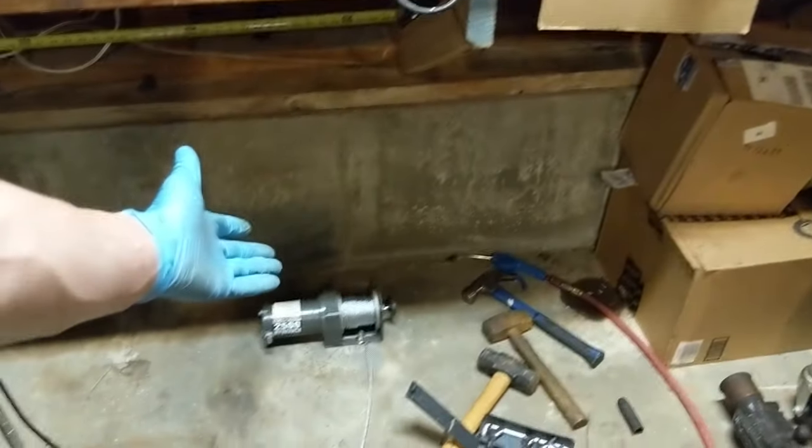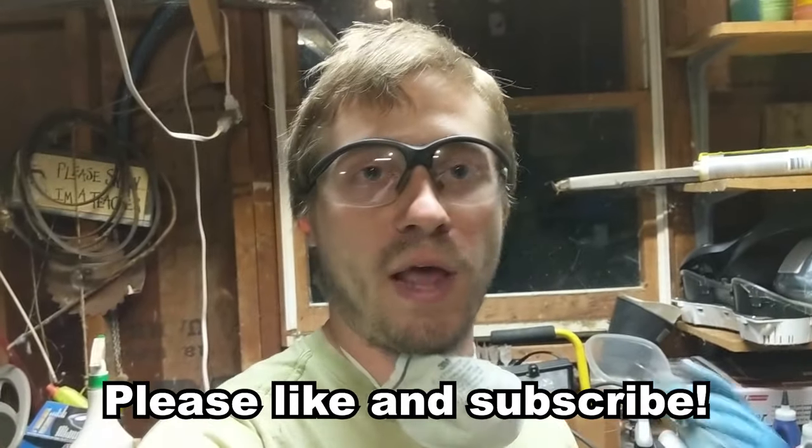Thank you so much everyone for watching 802 Garage and watching me attempt to install this winch into my garage floor. I am obviously not an expert at this — this was my first time drilling concrete and installing strike anchors. I think it went fairly well, although it wasn't quite perfect. My first tip: if you're not going to use a hammer drill, definitely step up in drill bit sizes and keep breaking up aggregate, but be careful not to make the hole too wide. My second tip: just buy a $20 hammer drill from Amazon if you're going to be doing more than a couple of holes — it would totally be worth it. In the next video, I'm going to show you how to wire it up and we're going to actually test it. Thank you so much for watching 802 Garage.